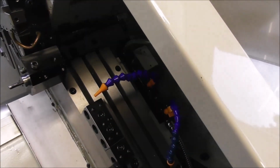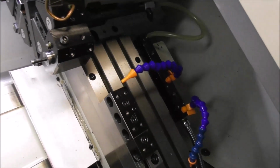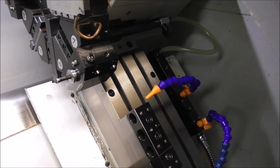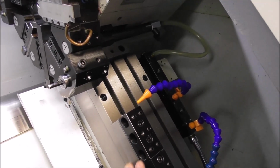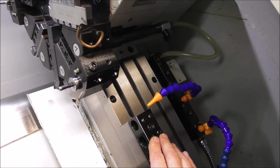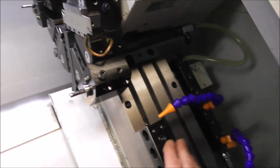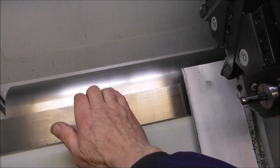And again, on the cross slide, on the X slideway, it's a very long length of slide, and it's well balanced, and there's probably Turcite under that surface, and there's much less weight on it. So all of those factors divide the local wearing stress on the surface down to a much smaller degree, so you've got much less vulnerability of the cross slide. It would be unlikely to wear much at all. So you're looking at areas that are vulnerable. That's that area there of the Z longitudinal slide.